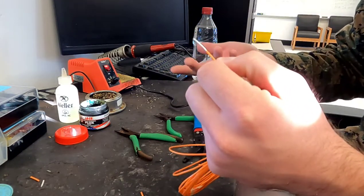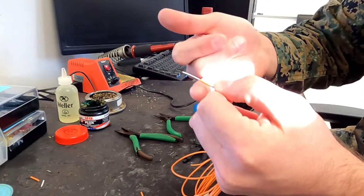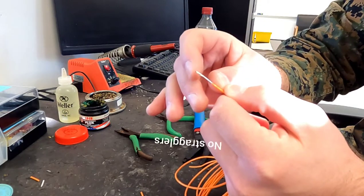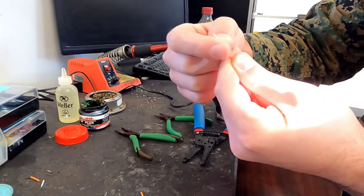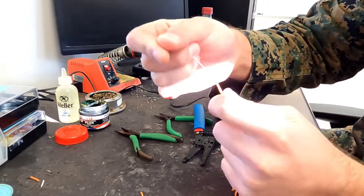So that's why we're tinning here today. All tinning is is placing a nice little coat of solder across my wire to make sure all these little excess wire strands don't fray out. That's what I'm going to be soldering this for, so I'll try to place it as cleanly as possible and use my solder to fix the rest.